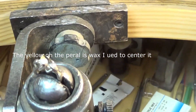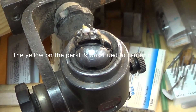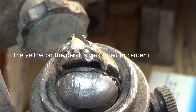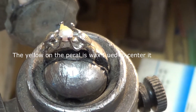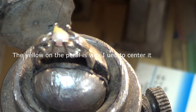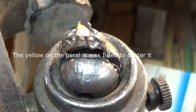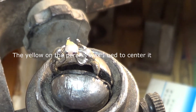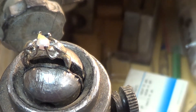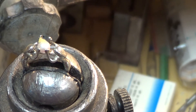These are the two wax carvings for the wedding sets that I've made. I went ahead and sprued them and took them to the back lab building and cast them — they came out really well. Now she's holding the pearls, and the only thing I've got to do now is take the four prongs and gently push them into the pearl. You have to be careful because the pearl's nacre scratches so fast, so I'll be extra gentle.